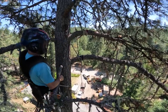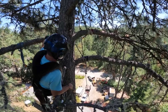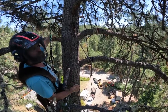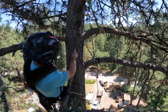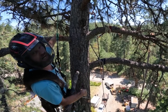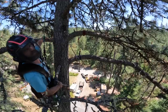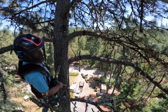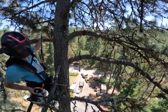Okay, YouTube, you see that? We're gonna do a big one, and we need a lowering rope guy too. This one's so heavy that I'm afraid we won't have clearance, and so this is a control line. We've got the control line and the speed line to direct the piece out over the house, but not on a one-way, hope-it-makes-it type trip, but on a if it ain't gonna make it, the other line will hold it up from crashing the house.